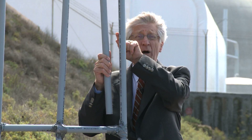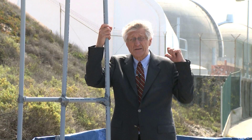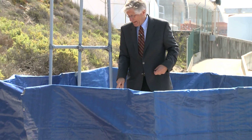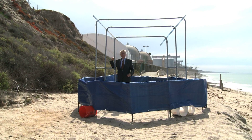At San Onofre, the tube that broke was because it was hitting another tube or it was hitting one of the tube support sheets. When that happens, not just one tube is damaged but all the surrounding tubes are damaged as well. The solution San Onofre is considering is to plug these tubes — they would send people down below and put plugs in the bottom of the tubes, which would keep the radioactive water out.